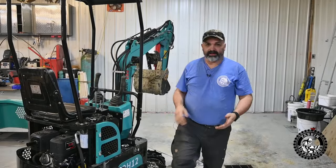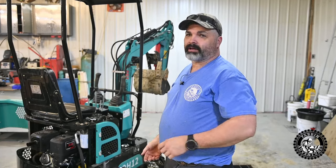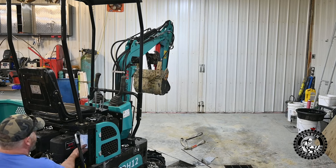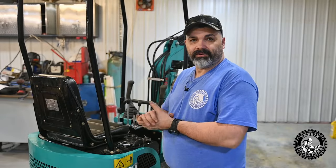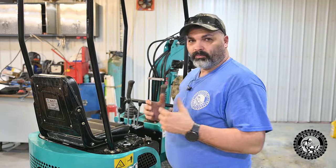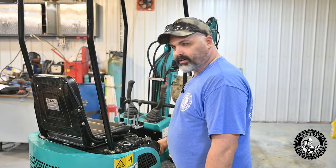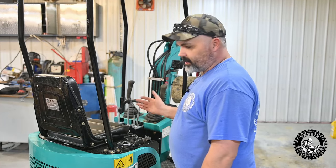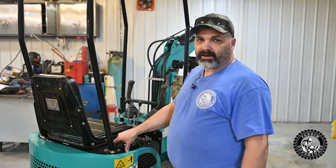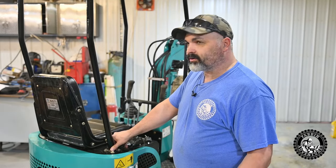She seems to work just fine. It was a pretty simple little job — it took a few hours to drain it, let it drain, run to town, get a filter, and all that stuff. But that appears to be the right filter, no leaks anywhere. So there you go — quick little hydraulic oil change, pretty simple, anybody can do it with just some minor hand tools. It was really pretty interesting to see all the filters in it: the screen filter that filters fluid you pour in, another filter inside the hydraulic tank on the suction line to the pump, and then a hydraulic oil screw-on type filter underneath — three actual filters, which is pretty impressive for the QH-12.